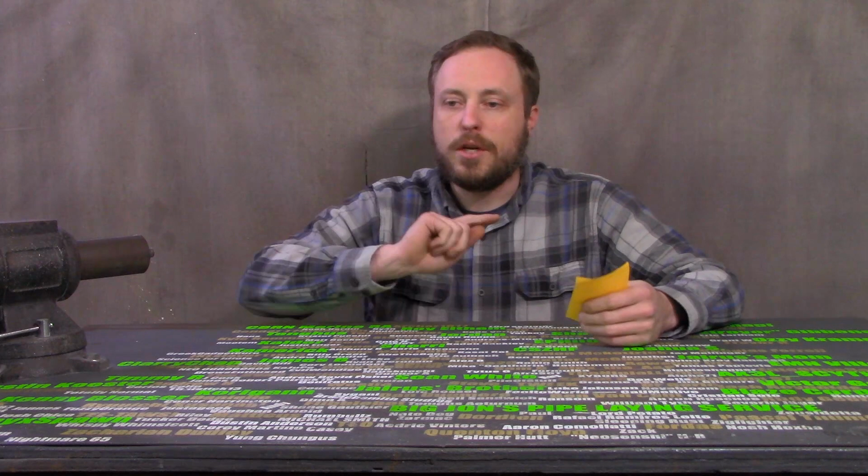I trimmed the handle, not because it was the wrong length, but because I didn't trim it in the first place just to make sure that my length overall was exactly correct. And it cut surprisingly easy with a fine-tooth blade on a hacksaw. To finish off the blade, I had to have access to both sides of the blade simultaneously, so I made super soft EVA foam soft jaws for my vise to hold the sword and not mess up the finish.